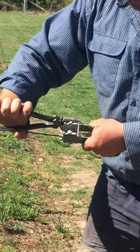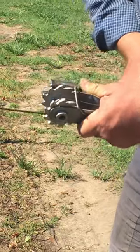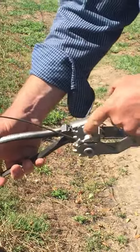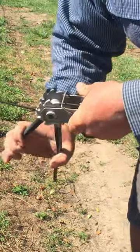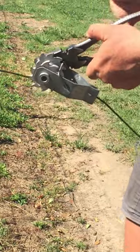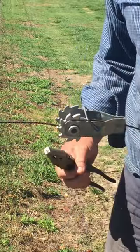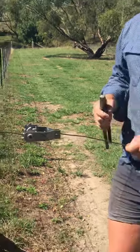If you get a good close up of that, you'll see that as I wind, it winds the wire around the centre piece. I always try to get right over in a big exaggerated move from one side of the ratchet to the other with the wire, and then come back and try to get it to cross over your original wires. That locks it in, as well as it's got a locking mechanism there, so as we wind that it just gets tighter and tighter. Usually you would put it on a half-firm wire — you wouldn't use a loose wire like I have, but this is just for the demonstration. And so that's how you use that type of ratchet in line.